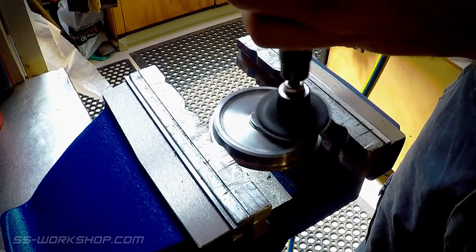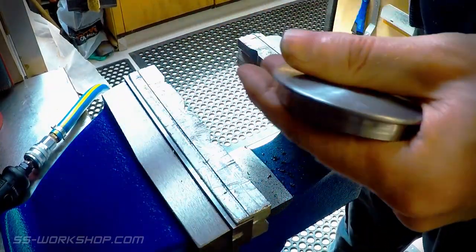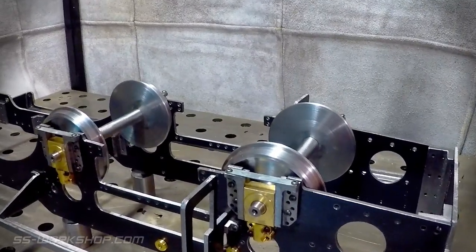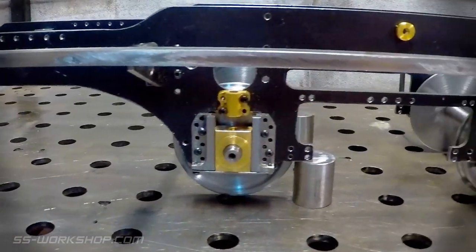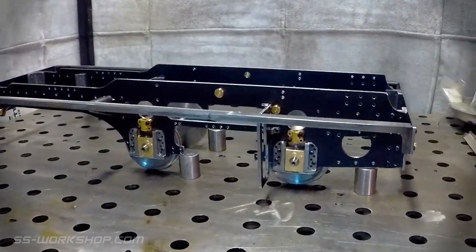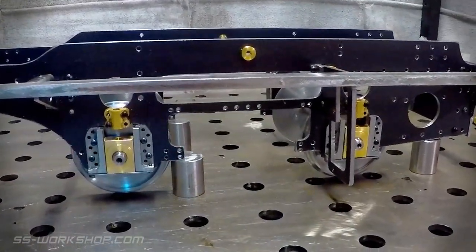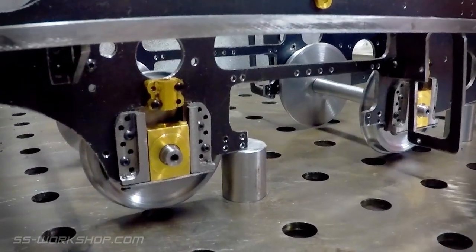The final process is to clean up the centre using the same method as the other side. As I'm going to use the Loctite method for fixing my wheels to the axles, I was able to temporarily locate the wheels on the axles for a test fit. In the next episode I'll be using the rotary table to cut the wheel spokes. I'll see you next time.